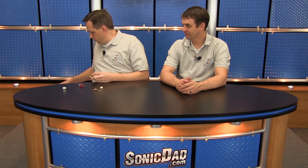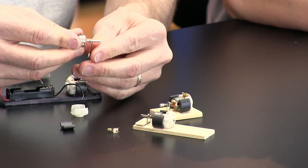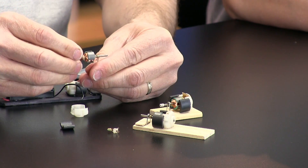I started messing around with some ideas using all of these parts to build little motors and I've got several prototypes. The first one is kind of ugly, but it got better. One of the things I discovered is that a size 00 safety pin actually makes a really nice little bearing — easy to size around the shaft. That's what I use for the bearing on each side of the shaft. And then just a piece of paint stir stick.